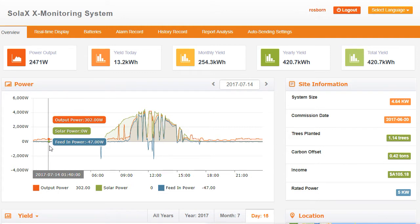Now, how these systems work — they are designed with a hybrid inverter to maximise self-consumption. You don't want to be producing your solar power during the day and not really using it, with a lot of surplus power going back to the grid at a rate which isn't very good for you. It might be 6 cents or 10 cents, but when you're buying power at about 28 cents a kilowatt hour, you're much better off storing it so you can use it at night time — saving 28 cents rather than just 6 or 10 cents on a solar feed-in tariff.